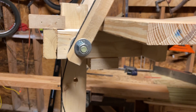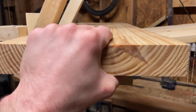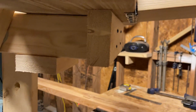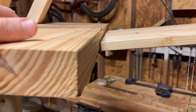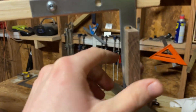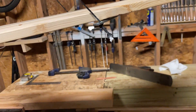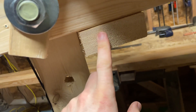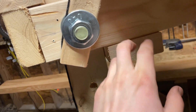This is just the first iteration of this whole thing. What I really wanted was to be able to hold up a hundred or so pound mantle with this stand, and that was accomplished. This crane part was more of an afterthought to see if I could do it, and it clearly works. It's just held up by a pretty common piano hinge there, so that might need to be replaced depending on how much weight it can hold. This is just a shelf bracket — a piece of wood for the latch. The way I put these catches the weight, so you can actually raise and lower it, but primarily it hits this, so at that point it's dependent on the shear strength of these screws here and up here.